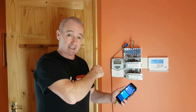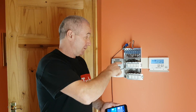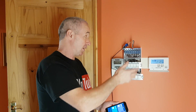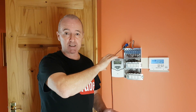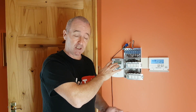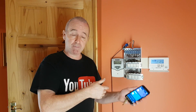I've checked it all out and everything is working fine. I still have to go around the system and debug it but so far it seems okay. When I bring the circuit on it's thermostatically controlled — so although the power comes on and the actuators and boiler come on, they all go through thermostats in individual rooms so the room doesn't get overly hot. I've got underfloor heating all of downstairs and now I can switch it on from 100 miles away.